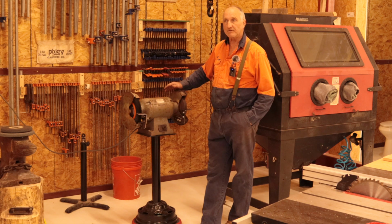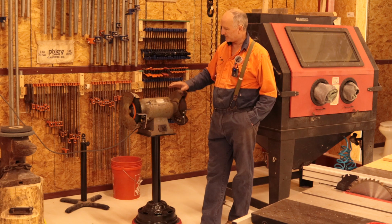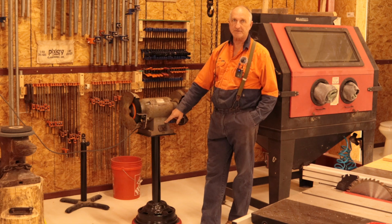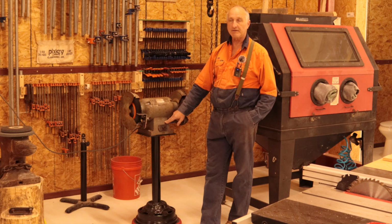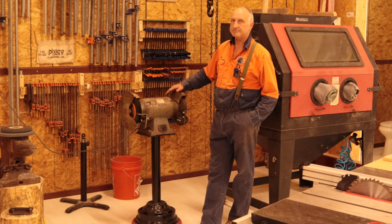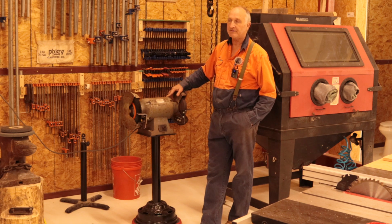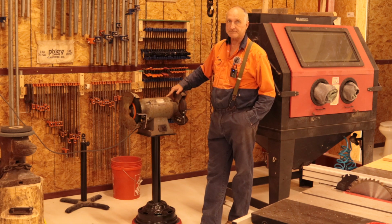And his dad, the only information he could get from it was when he plugged it in and used it, it would pop the breaker. And he turned it upside down. Inside this little base is a capacitor. His was missing. The one I had in here was blown out. Well, okay, that's the same thing that happened with this. The first time I turned it on, it would start once.